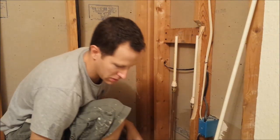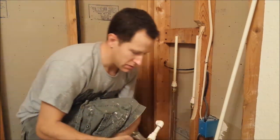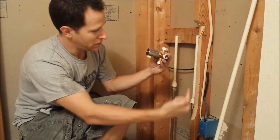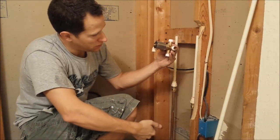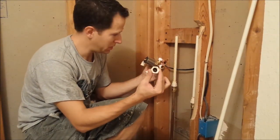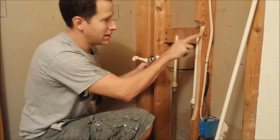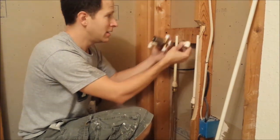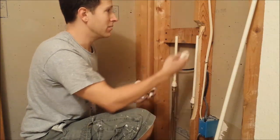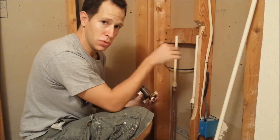It's been a few minutes — I went ahead and attached all of the fittings together. This is our mixing valve. This piece has a spot that says 'up,' so make sure that's facing up. Hot and cold come in on the sides, down goes to the tub, and when that's stopped up it sends water to the shower. I had to make some adjustments — this end needed to be a lot shorter. I also had to notch out a piece of this 2x4 to allow this to sit flush behind the 2x4s while not protruding out, so that when I put the hardyboard up it won't stick out and I'll have a nice smooth surface to work with.